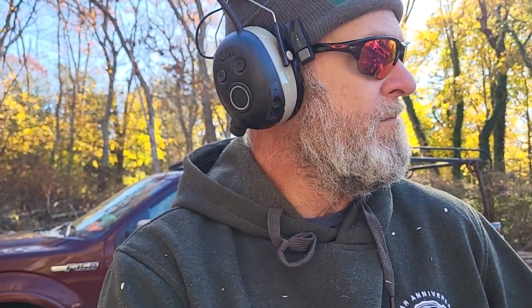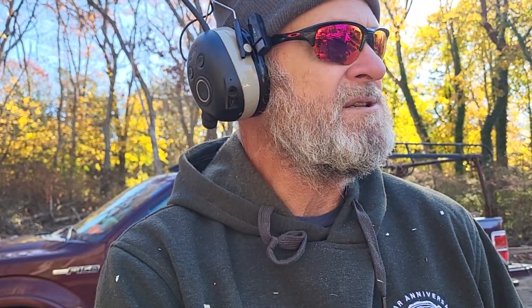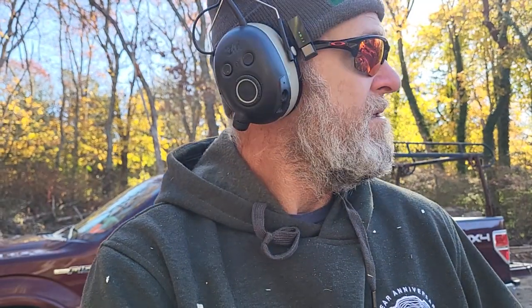And I hope one thing that was really apparent was how smooth it cut. That's just because you stay on top of your drags and take them down with a progressive gauge. You can get those progressive gauges at Bailey's, or you can buy them on eBay. If you look up Husqvarna progressive raker gauge, you can find them there. It's the only way to go. Trust me. It's fast, and the saw will cut really smooth like that.